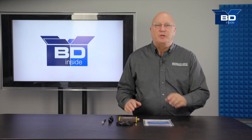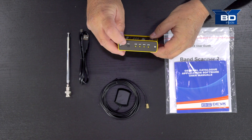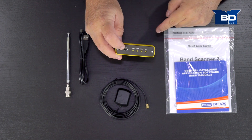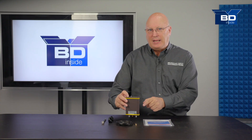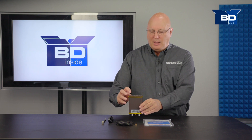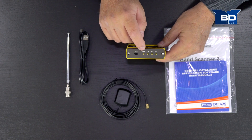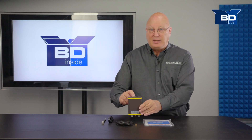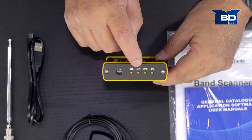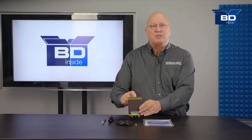The view of the Band Scanner 2 is quite simple. On the back there is a USB connector that connects to a Windows-based PC. It not only sends your data from the Band Scanner 2 to your PC — the mini USB also sends power to the Band Scanner 2 from the PC. The LED lights will show what's going on at a glance. The USB LED is going to be lit when the USB is attached and connected to a PC. The antenna LED is lit when you have an antenna chosen, selected from the preferred input in the software.